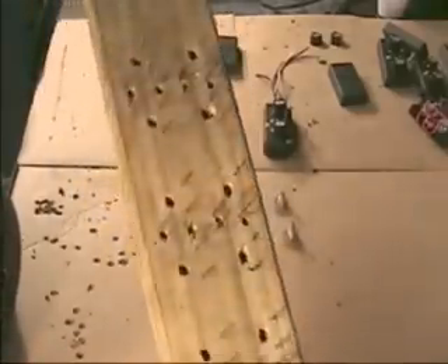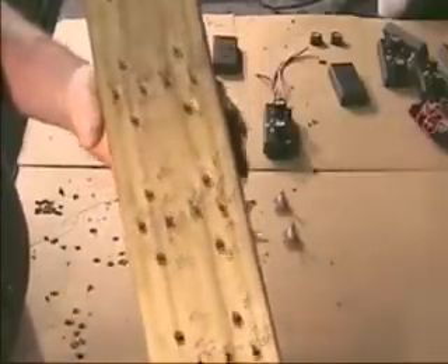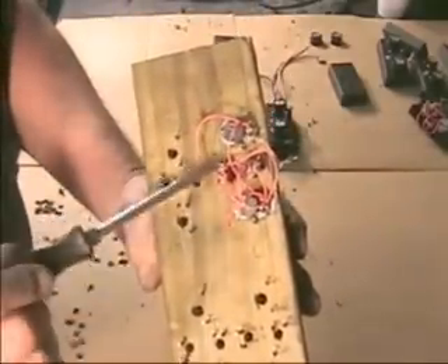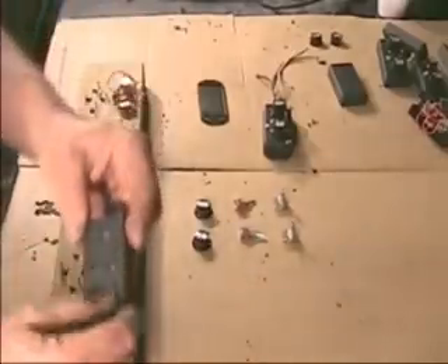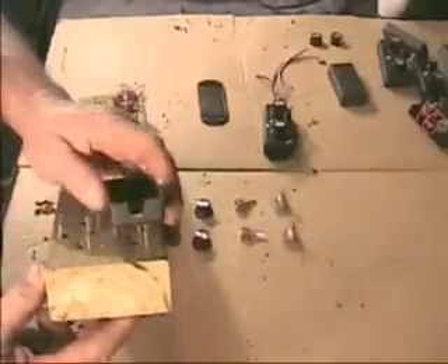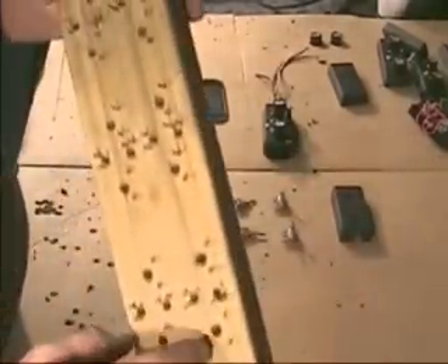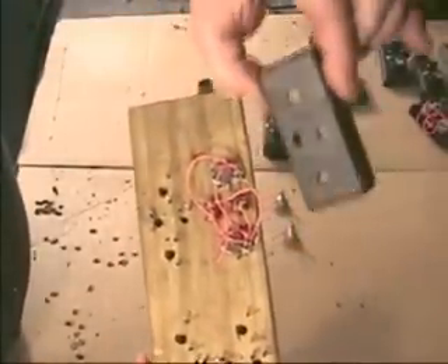This is the fixture made out of a two-by-four. You can see right here that we've placed these little finishing nails so that when we place the fixtures in there, they'll be oriented according to how they will fit into the enclosure. To make this, get whatever enclosure you're going to use, place it on the two-by-four, mark them, and drill the holes. That gives you the fixture positions for the potentiometers and toggle switches, so once you solder everything together you simply remove them from the template and they'll fit perfectly into the enclosure.